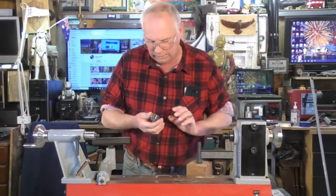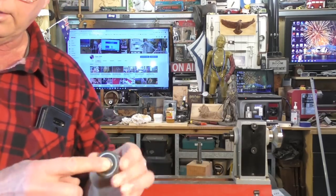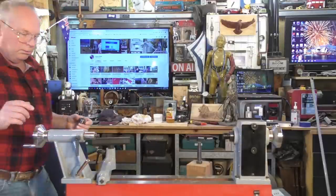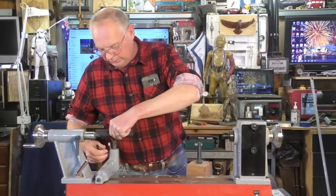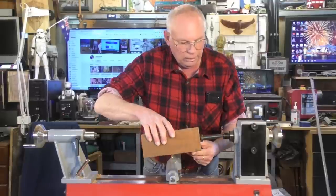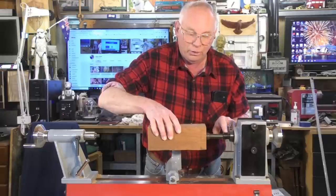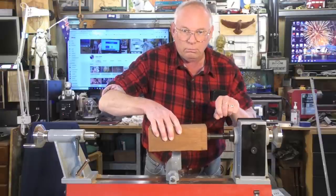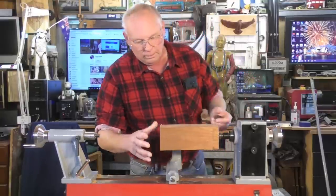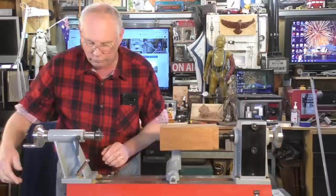Now, this is the tailstock spike, and it's got a bearing here. It's a spike that fits in the other end, so it's held between spikes, as it were. Just take this off a moment. Now, I've got to push this in there quite firmly, because it relies on the taper inside of this shaft to actually grip. That's all you need to do. It'll hold that. So this goes on the end of here. There's a taper in here, this end too.